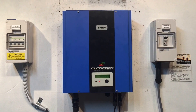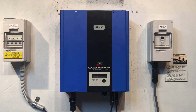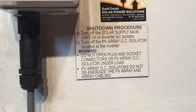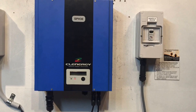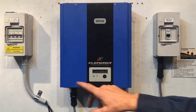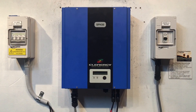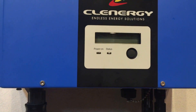With any problem on a solar inverter, always try a reboot first because it may clear the glitch. Follow the shutdown procedure: first, turn off the solar supply main switch or inverter AC isolator — the solar supply main switch is on your switchboard, and you may or may not have an inverter AC isolator depending on where it's installed. We have one here, so we'll switch that off. Then turn off the PV DC isolator located at the inverter — we'll throw that off as well and wait for the inverter to go completely dead. It's totally black now.